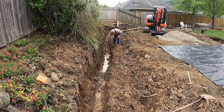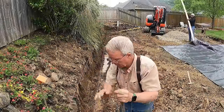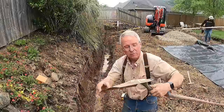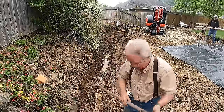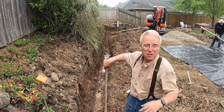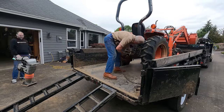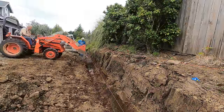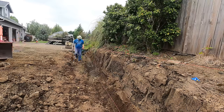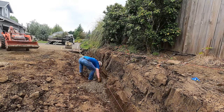This string is for grade on the French drain. I'm going to compact some one-inch minus down to 12 inches below that string — 12 inches is the length of a square shovel pretty much — so we can sprinkle gravel in there and use the string at the top of the shovel to strike the grade off. Then we'll compact it and fine-tune it. The pipe needs to be laying in there well enough that water stays inside the perforations on the bottom. What the pipe is really doing is preserving a hole in the dirt so there's always a place for the water to go.